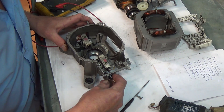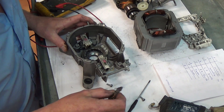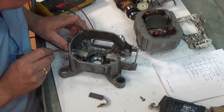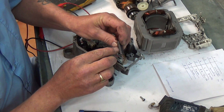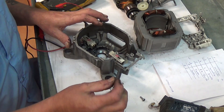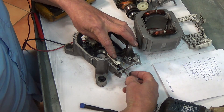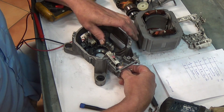Sometimes when new carbon brushes are delivered they are very tight in the holders. The spring is designed to absorb and push the carbon brush onto the commutator perfectly. Because of the heat from the old worn brushes, these pins can become slightly distorted. If you look closely after sliding the carbon brush in, you'll sometimes see a mark appearing on either side. On very fine sandpaper you can just sand it down slightly so it slides easily into the holder. By lifting up that pin, it's now sliding in a lot easier - it was just because the heat had caused the plate to slightly warp in shape.